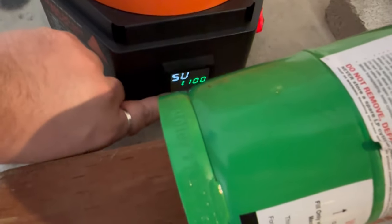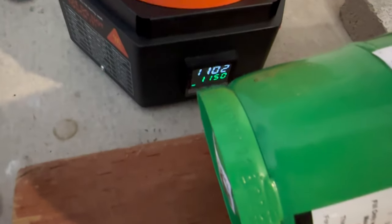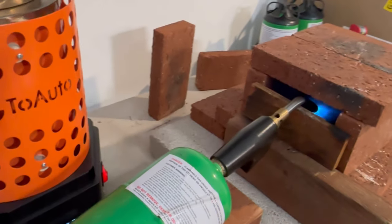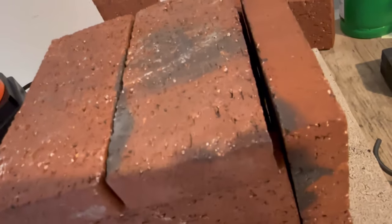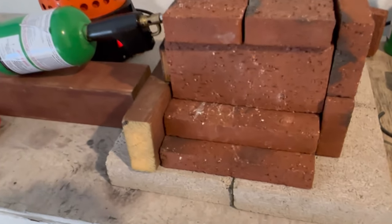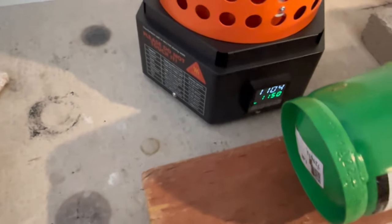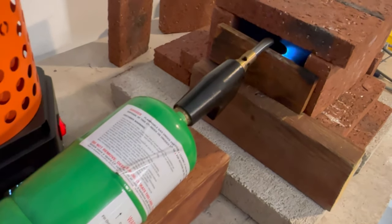I also toggle the temperature on my furnace — this isn't something I've really talked about. I had it at 1100 degrees and now I'm moving it up to 1150. Sometimes I'll even put it on 1170 for a short amount of time right before I pour. But I think it's important to move the temperature back down to 1100 when you're not actively melting silver, to let it rest — or you can just leave it on 1150.